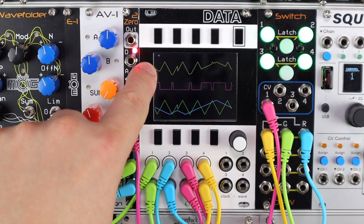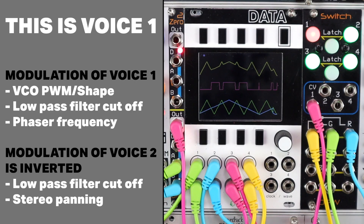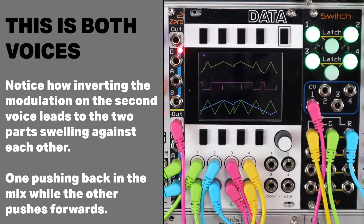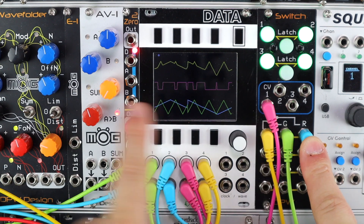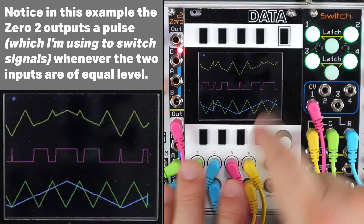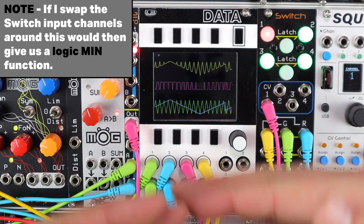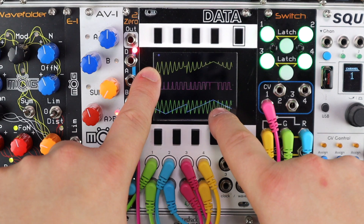In this patch the yellow trace is doing all the modulation of everything going on, other than the pitch sequence. I have two triangle waves going into Switch — I'm switching them with the signal generated by Zero2. Both LFOs are also going into the A and B inputs. We can really look at this like a logic maximum function — if we follow what's going on at that output, it's kind of like a logic MAX, and you can see this max voltage. It's a really nice way of mixing those LFOs using this max function rather than just mixing them. We can also do octave dividing with the latch, and it'll only go up to that faster rate once every second time.